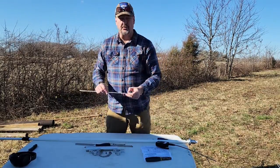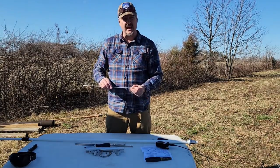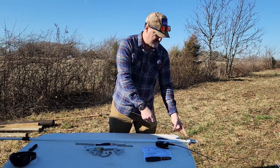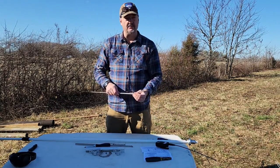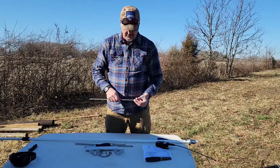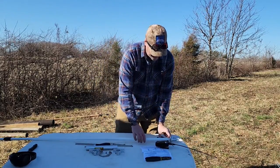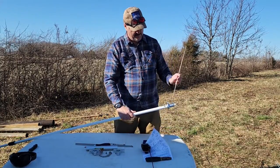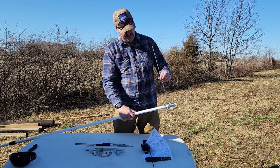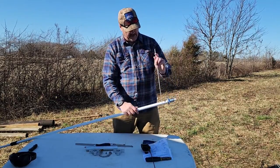And then we're going to screw the radials onto the antenna, and then the nuts will come down and tighten against this housing right here, which I'm not sure what that's made out of. We're going to say it's aluminum or aluminium. Alrighty, and so we'll pull this down a little bit. Let me move a couple things so that you can see, but basically now what we're going to do is screw these into this bulbous little housing element right here.